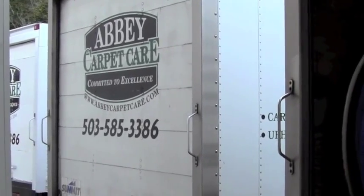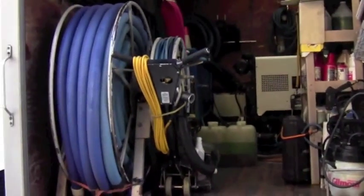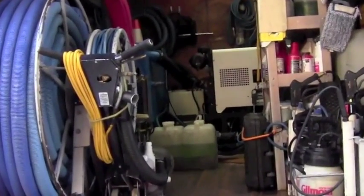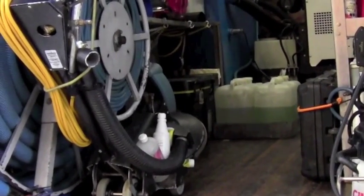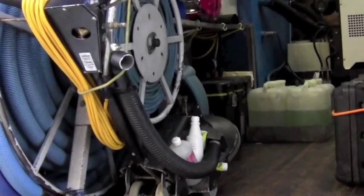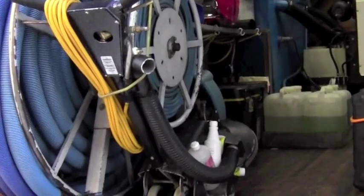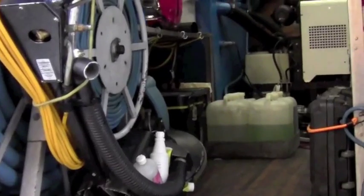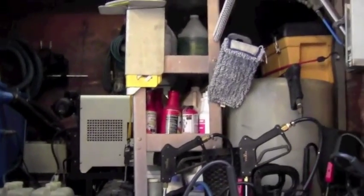Both vans are set up the same. This is the backside of the '04, and we're also going to talk about the '05. This one uses a ProCam hose reel and the old-style RX20. We really go for the old-style RX20s — this is the low-speed version. We found they're really cheap and easy to rebuild, and I don't think we've ever spent over $400 for an RX20. We've got five of them: two as backups, and we just cycle them through when they need to be rebuilt. One of them is over 25 years old and it's still going strong.